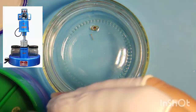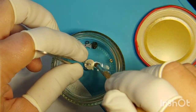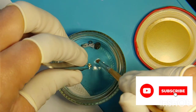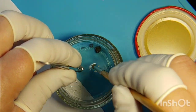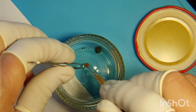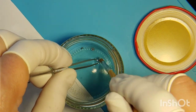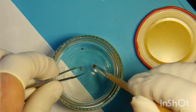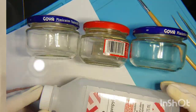I have a project I'm putting together about how to make my own semi-automatic watch cleaning machine, so if you haven't subscribed, do so now so you don't miss it. I divide the cleaning process into two different stages. The first is the degreasing stage where I place parts in a glass container with naphtha and use an artist brush to remove grease from parts.